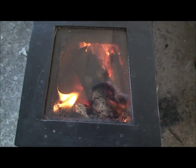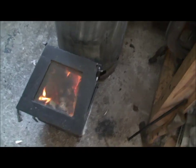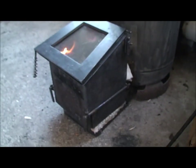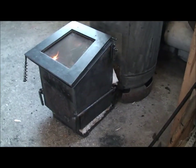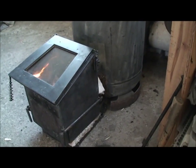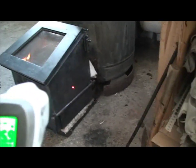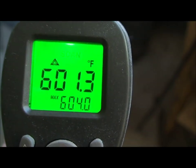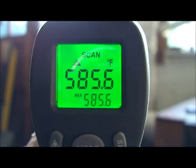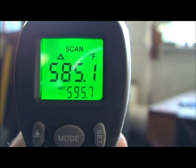I'm really happy with this stove - it's just fantastic overall for the amount of fuel I use and burn on it. The only thing I am going to do is increase the height of that firebox - I'm going to roughly double the height of it and put that glass door back on. Incidentally, the temperatures at the outside of that firebox are about 600 degrees, which is roughly the same temperature as the side of the stove.